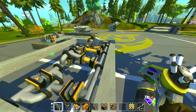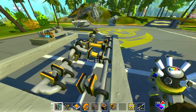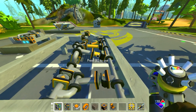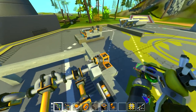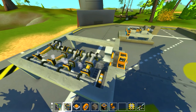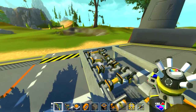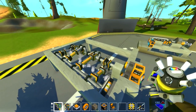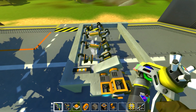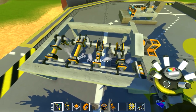They'll just all be kind of like getting dragged along through the process. And then this one will have just finished its activation here. This guy that's fully extended, and then this one will activate, which will push this forward to where that guy is, which means this one will in turn be where that one is, and the chain just continues down the line. And it makes for a relatively smooth engine. I mean, it is very smooth. It'll always spin in the one direction, which is great, because depending on how you have the 90 degree offset, you can change which direction it spins in. But it'll always spin in one direction. It has four pistons worth of power, and it'll spin relatively straight. But it is still pretty bulky. You know, very horizontally bulky.